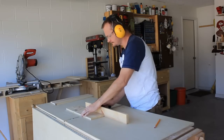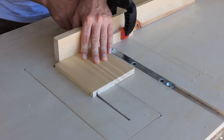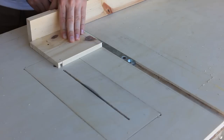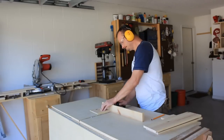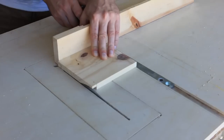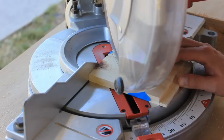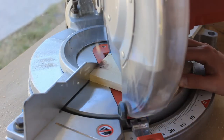These are going to be the sides and I'll cut rabbets in each one for the shelf. The other rabbet for the back that will have the pegs. Then cut a couple of 45-degree angles in each side.